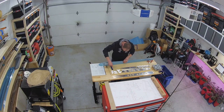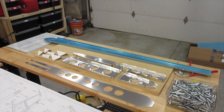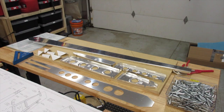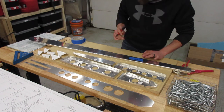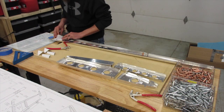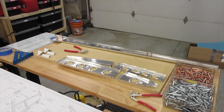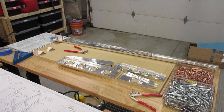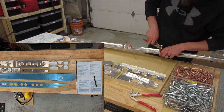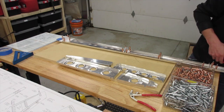One of the first decisions I had to make in this process was the prime or not to prime question, which there are certainly a lot of opinions about in the field of home-built aircraft. I chose to go with the priming approach, so I went ahead and removed all bluing from all of my pieces. Some of the pieces that come in the kit are already exposed aluminum and don't have bluing on them at all, so that's why you don't see me removing it from every piece.